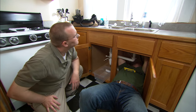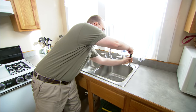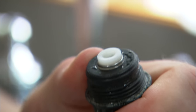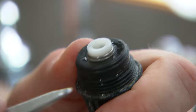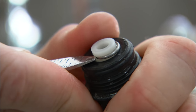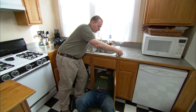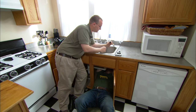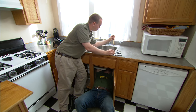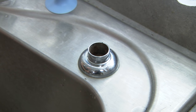I'm going to push up this spray hose. Now loosen the bottom big black nut from the spray head. You should see a little C-clip on the side — a little retainer clip. Just pry that out with a small screwdriver. It's coming off. Clip's out. Just pull the base off the hose — pull it straight up. It's off. Now I'll take the hose down here and dump out the remaining water. Pull that faucet straight up and out.